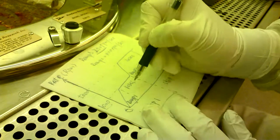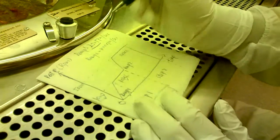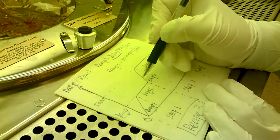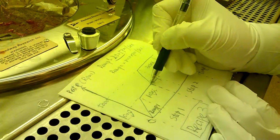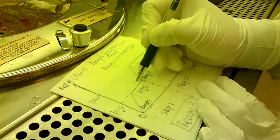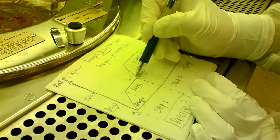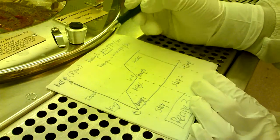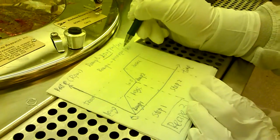The first one is the ramp up, the second one is the holding period, and the third one is the spin rate. Same as the second step. After that, you need to set how much the ramp up is for the second one. You have to remember the start rate is 1,000 here, right? So what you need to set is from 1,000 to 5,000, the acceleration, such as I want to set 1,000 RPM per second.